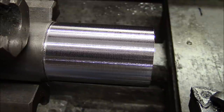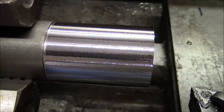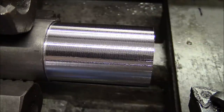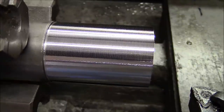Before you take any measurements, before you make any decisions, you need to evaluate whether or not the machine can make good parts. In the case of this machine the answer is no, at least not without a lot of struggle. So this is a piece of inch and three quarter diameter 1045 sort of medium grade cold rolled steel. I set up and took a test cut at 700 RPM, feeding at 14 thousandths per revolution, and the infeed was 80 thousandths on the diameter — 40 thousandths on a side.